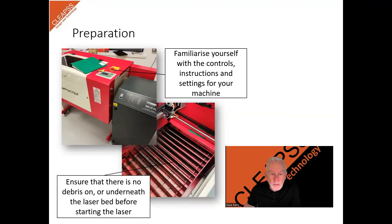Preparation. Before using the laser cutter, make sure the work area is clean and free from any clutter. Also make sure that you have read the user manual and familiarise yourself with the machine's operation. The machines are usually quite large, but you should make sure that they are securely positioned before they are in use. As laser cutters used in schools must be fully enclosed and have interlocked covers so that they are certified at Class 1, there should be no need for any PPE such as eye protection.